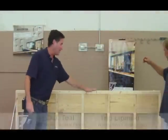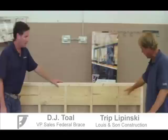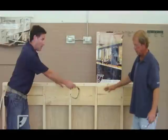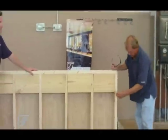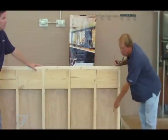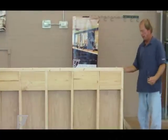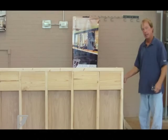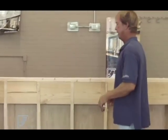That keeps us flush for hanging the sheetrock over top. We put 16-penny nails across just like I showed on the first block. Now you can see we have it blocked all the way across — these are 16-inch centers, which is typical for how a house is framed. On this one, we've attached the wall to the cabinets and to the floor to keep the wall from tipping over. In normal construction, the cabinets would already be attached to the wall from the back side.